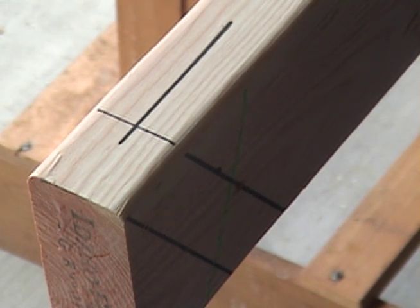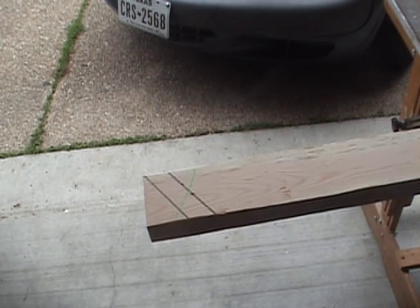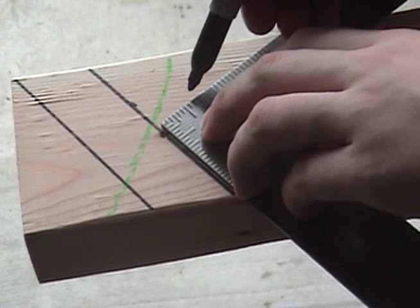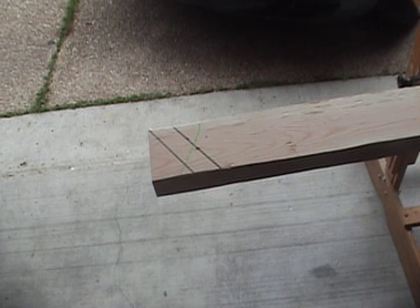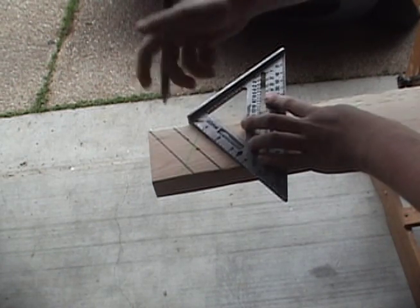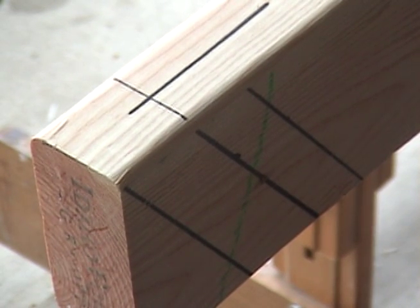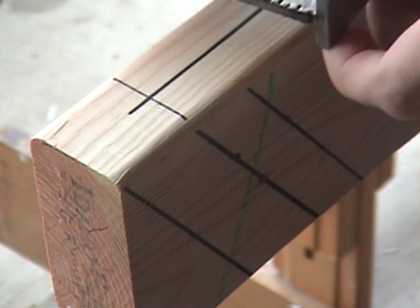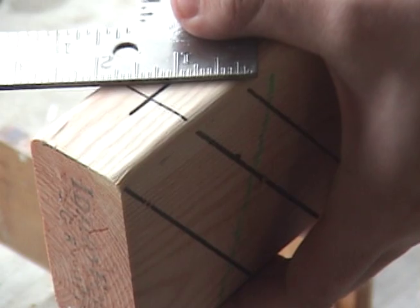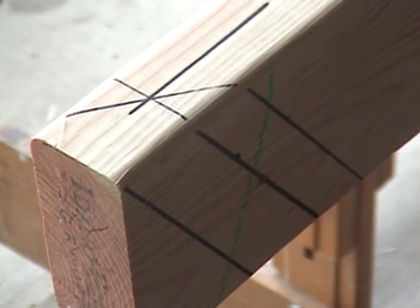The reason why we do three-quarters is because it's the halfway point for this thickness. Then we flip it over again, and from our second plumb line, we go three-quarters away from it. We take our speed square and pivot until that same 11 is on the edge of our board, and draw our third plumb line. Then we flip it over on top again, and from our third plumb line, we draw a line connecting this point with the center point. We take our ruler and connect the two points.